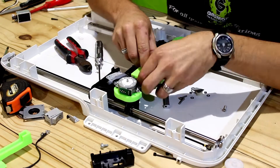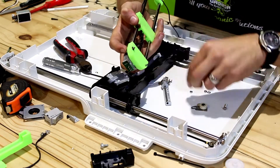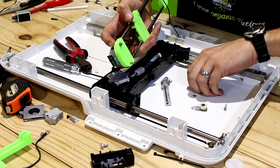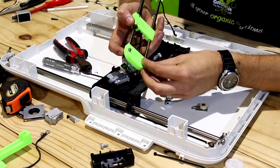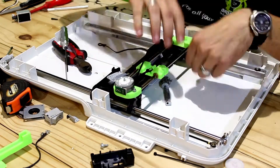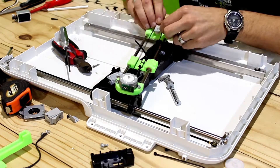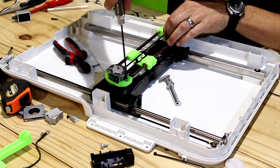After designing the parts in Google Sketchup, I printed them out with my 3D printer. The motor and the belt come from an old dot matrix printer I had lying around in the shed. I designed it in such a way where I could easily assemble it into one unit, not having to worry about it being bolted down in any particular way, so the entire y-axis ends up being a unit on its own.